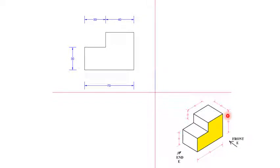Just draw the top line. Once you complete that top line, you have finished drawing this shape. As you can see, this line is 70 millimeters, this one is 50, the top part is 40 as indicated, and this line is 20 millimeters — therefore this one is 30 millimeters. If you look at this shape, you will see that this yellow shape is the one we have drawn here. Only this is in isometric and this is in orthographic.